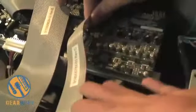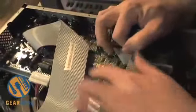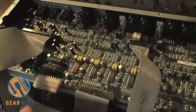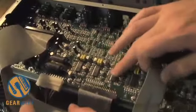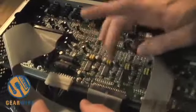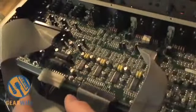Here's the original. The way the converter circuit is set up is not really even what most systems use — they use a slightly better configuration than this. The same goes for the A to D stages here. It tends to give a bit of a hazy, undefined sound to the converters, because basically there's so much noise on the power supply rail and it's feeding into each converter and coupling over into the converted digital data.